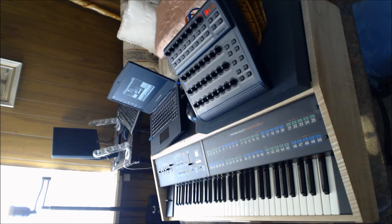So I was programming it, making sounds and things, and it was wonderful. And then it went on the fritz. And I found out it was the power supply. So I believe I took it back to Wes again, and he fixed up the power supply and calibrated everything. But he told me how terrible it was. It weighs like 10 pounds, and it's got a big old power converter in there, and it heats up, and it causes the voices to detune, and it also sends out erratic voltages, so it can fry the brain of your Chroma and fry your boards. That's also what has happened to many Chromas, is total failure. There's no fail-safe device, it just fries the whole thing.